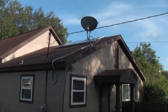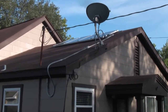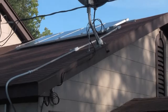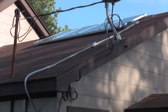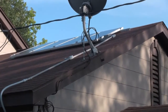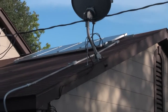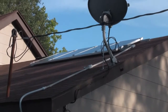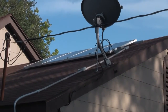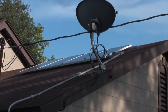Finished installing the panels and everything's wired together, but ran into some problems. Had to pull all the panels back off because we didn't have any voltage when we got the two wires into the house. Backtracked everything and found that the T-connectors — which are $20 a piece and pair two panels together so you only have to run one set of wires — had bad connections. So we yanked them off, cut them, spliced the wires back in with wire nuts and tape, and put them in a box.